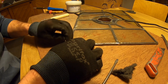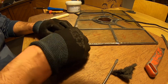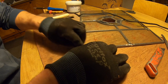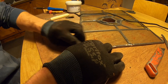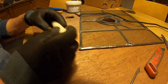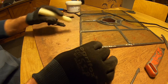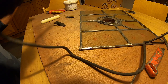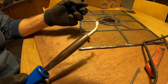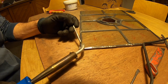I don't really know what I'm doing here, but I'm cleaning this up with a bit of quite coarse sandpaper just to rough the surface up, then a bit of steel wool to clean the surface off. This is a tallow candle, tallow flux - a little bit of flux on there. My soldering iron is a 100-watt, 10-pound soldering iron, and this is a 40-60 solder from some stained glass window guru, and I'm going to try and solder that join now.